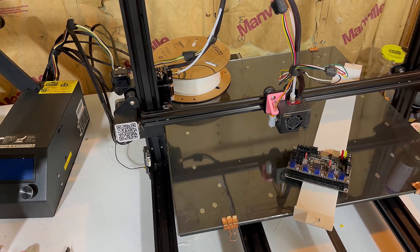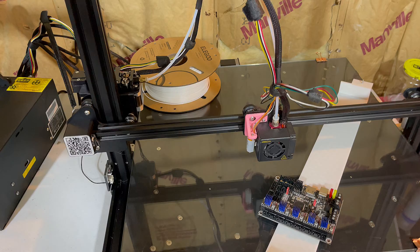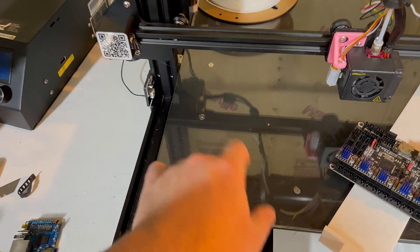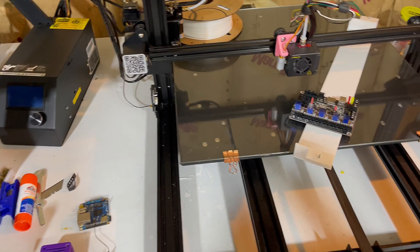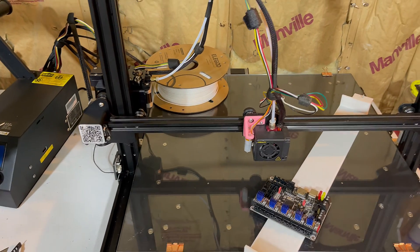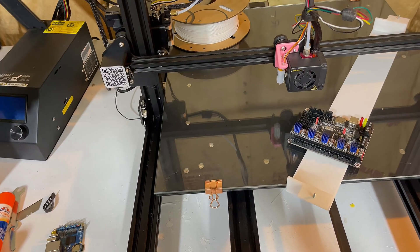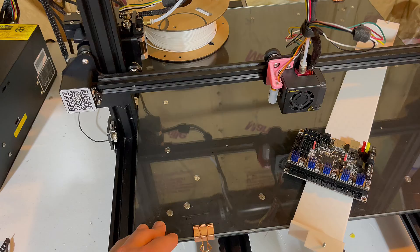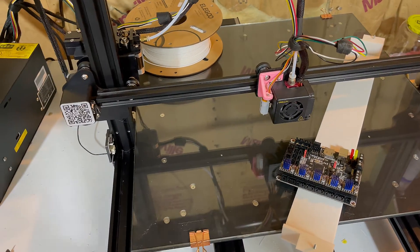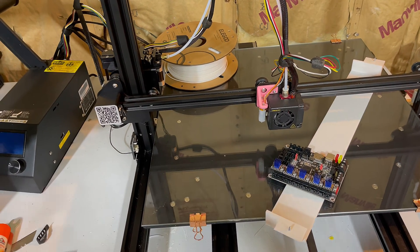It's a difficult thing to say — with that same amount of money, you can get a brand new printer that prints up to 500 millimeters a second, like the Elegoo Neptune 4 Max. You do lose some volume — it's 420 by 420 by 480 — so you can still print tall, but not as wide. You're probably going to do about a third less of the bed, but regardless it's still going to get you printing a lot quicker. I don't see a point in printing faster with this, to be honest. It's nice to have a lighter bed because this thing swings back and forth and almost tears your table in the process. It would be nice to switch to a lighter bed. Because you're now on Klipper with the BLTouch — probably the most accurate device to get a bed level — it doesn't matter if it's metal, plastic, or glass, it'll work on every surface. It's a much better purchase to at least lighten the bed in that regard, but again, that's like $100 minimum.